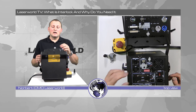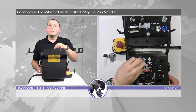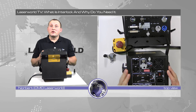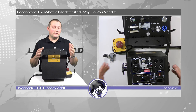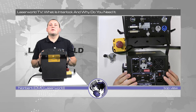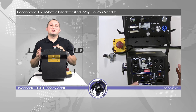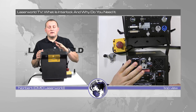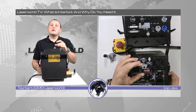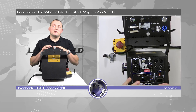So why do companies deliver bridging plugs for the interlock connector if it's required to have an emergency shutoff button connected to it? Of course, it is required to have an emergency shutoff button at every laser show — if you operate the laser you must have an option to emergency stop the laser emission. If you use the interlock connector directly, which is recommended, you need to run an additional wire from the unit to the interlock connector to have the shutoff.